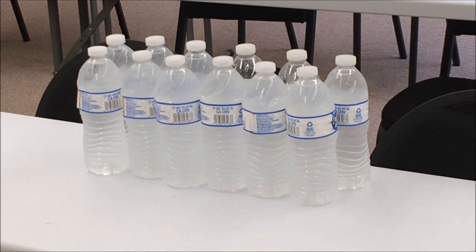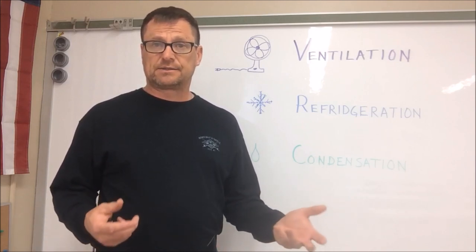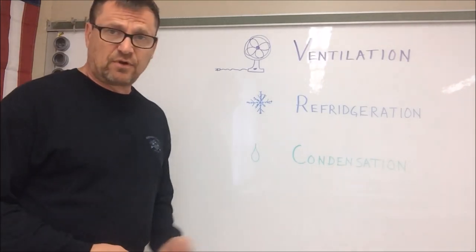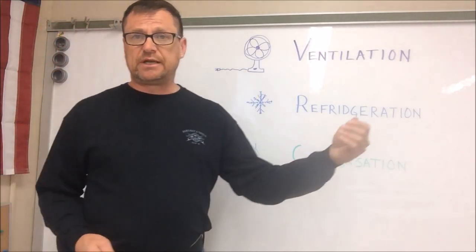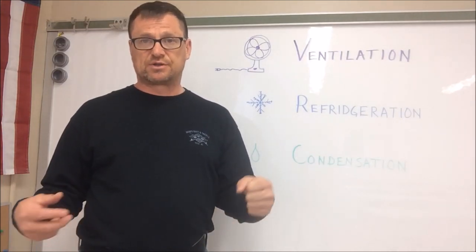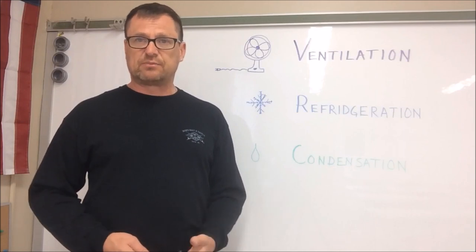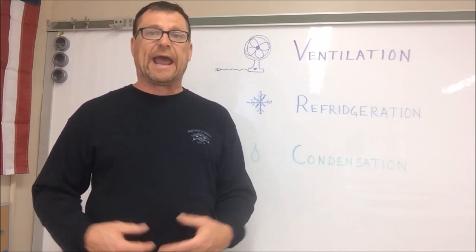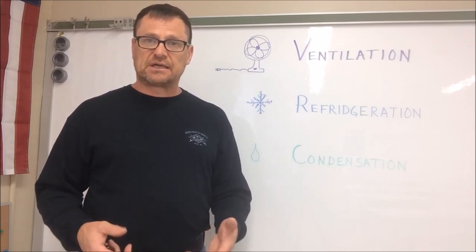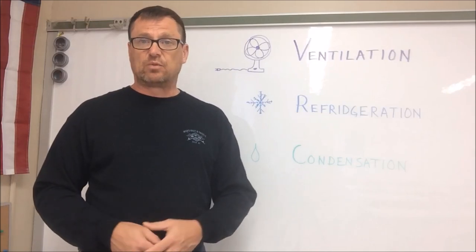So now that we've talked about the ways that we add humidity to the air, let's talk about the ways we can control or eliminate it. One of the first ways is ventilation. If the humidity is higher on one side than the other, it's going to travel to where the humidity is lower — and where it's drier, it's going to pull that humidity in, unless there's a barrier in place. So if it's very moist inside while you're sleeping, and the temperature outside is comfortable enough, ventilation is a key factor — having windows open, having fans blowing that help turn sweat into vapor which dissipates.